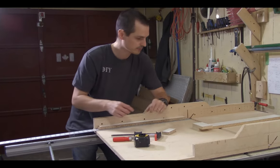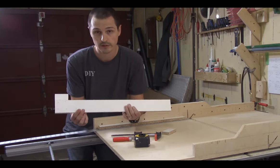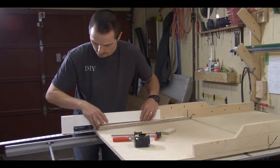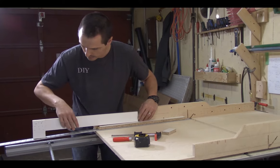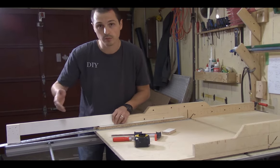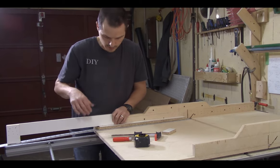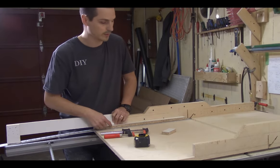If you want to go beyond 23 inches, take an off-cut of the material — or something thicker than what you're using — and put it down first. I made this simple little jig: it's just 5/8 melamine with a brad nail on the end. Put it to wherever you want — if you want to cut at 30 inches you can go all the way; with this jig I can go to about 40 inches. You can build a longer arm if you need to go further and you can be very accurate with your cuts.